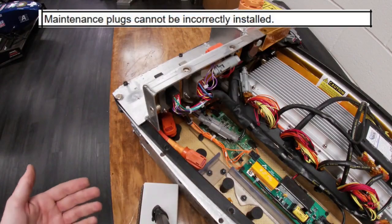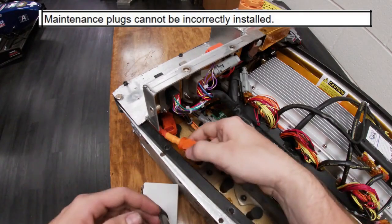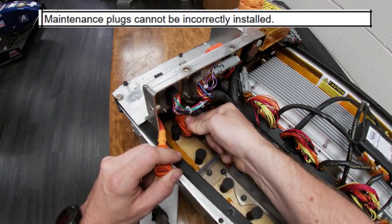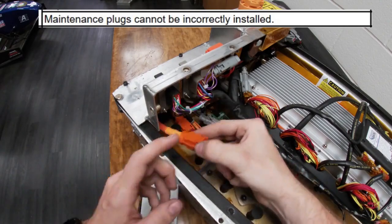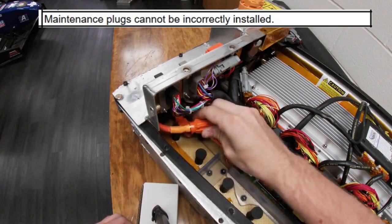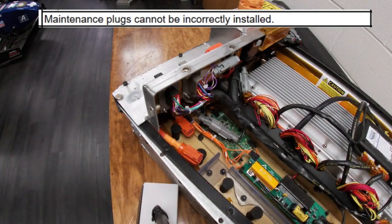For the two maintenance plugs in this corner which are tied to the lid that's currently installed, they are trimmed in such a way that they can only reach the radlock pins which belong to them. If I lift this one out of the way and pull on this, you can see that this is as far as it can go, and it can only reach this pin, which is the one it's supposed to go to. If I push that one out of the way and try this one, it can reach the pin it's supposed to, but it cannot reach over here. If I try to bend it back or push it in to reach the first pin, it will not reach.